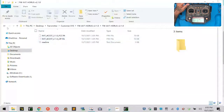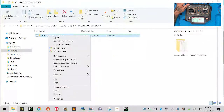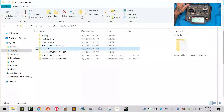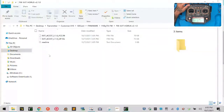Here are your versions. What we want to do is double-click on the XJT folder, take the second folder, right-click, left-click Cut, go back to your folder, go to the SD card, go to Firmware — remember we created these folders ahead of time. We want Transmitter here, so paste it. The XJT 2.1.0 is going to be sitting right here. This is what we'll flash our radio with to get it back to using ACCST and not ACCESS.